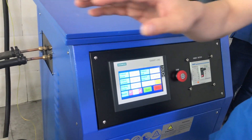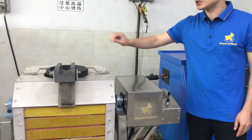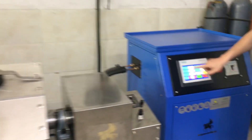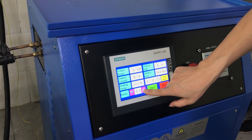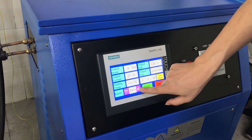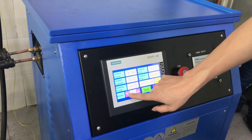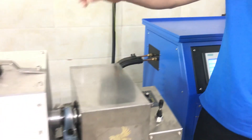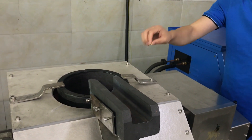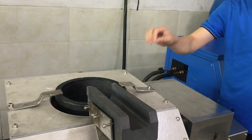Let's pay attention to this: if we use this crucible for the first time, we must heat the moisture off. It will take two to three hours with a power of 5 kilowatts — set 5 kilowatts. This will dry the crucible and make the crucible life longer.